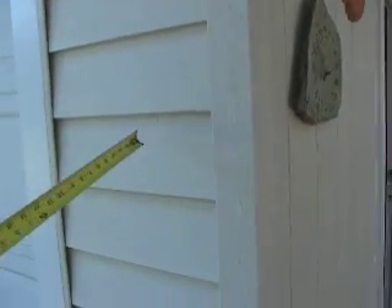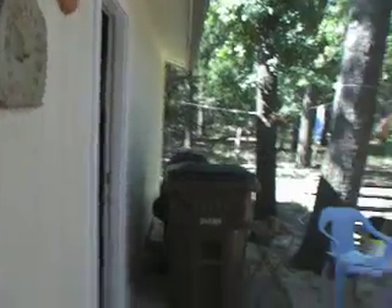Let's go around the side here. For our color, we're going to match what this has — we match the vinyl colors. So we've got a white vinyl fascia and then we've got like a light tan wall that we'll go back up with. So let's match this vinyl and this coil stock for the color scheme around the rest of the house. Looks like we've got a new door in there to work with, so let's take that trim off and put Hardy trim on a one-light right there. Not doing anything to the front of the building, but we are dead-ending into this piece of flashing right here. This will all get painted — the soffits after we make our repairs and replace the fascia and go back up with a DL drip edge, and then paint that when we paint the project.